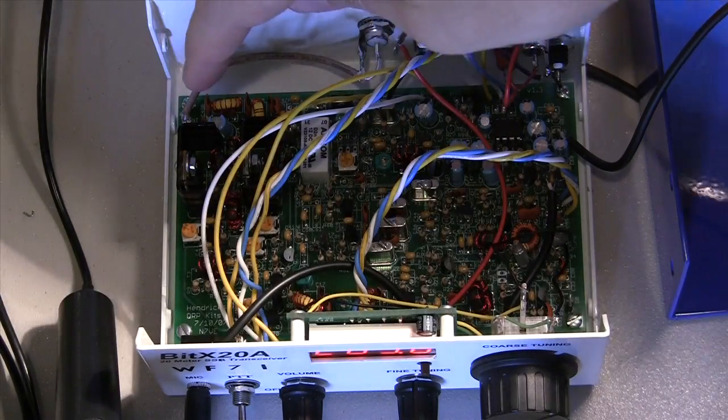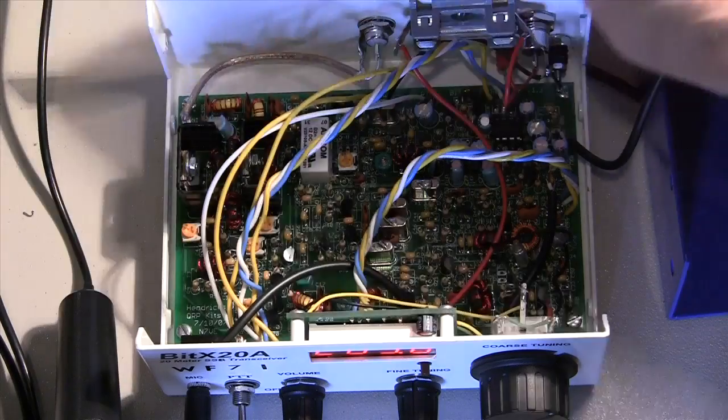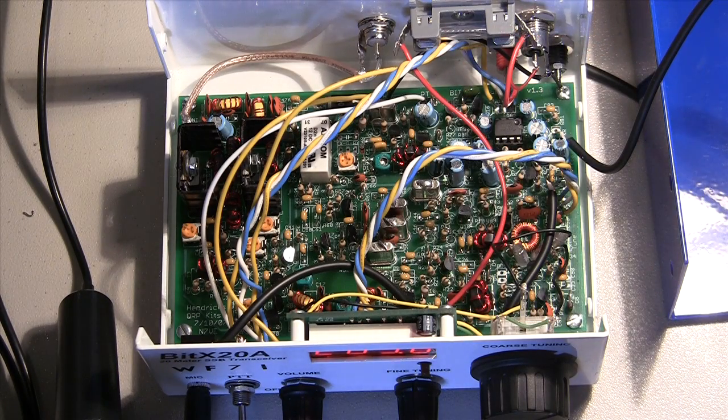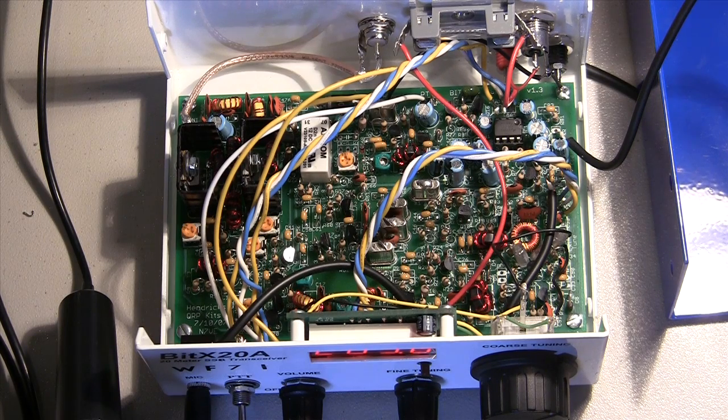All this is just hookup wiring going to the various controls. The RF output from the PA comes out over here. I have a little section of thin coaxial cable from Radio Shack — it came with a BNC connector already soldered on and has allowed me to make several little jumpers for kit radios. It allows you to have a shielded connection from the RF output to the BNC. I put in a four-amp fuse — typically on transmit the output is between five and ten watts peak, five to seven watts average, and I'm usually below two amps. The fuse is there so if some runaway oscillation happens and it draws a lot of current it will blow, but normally it won't.